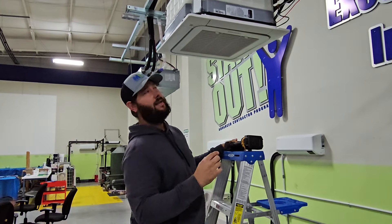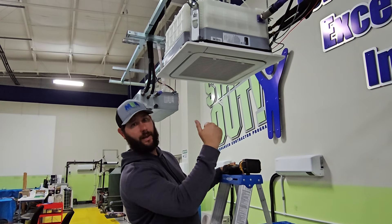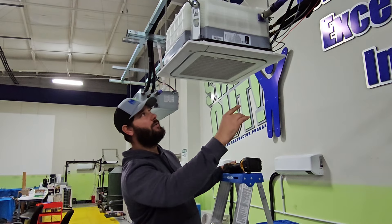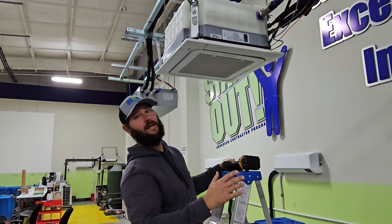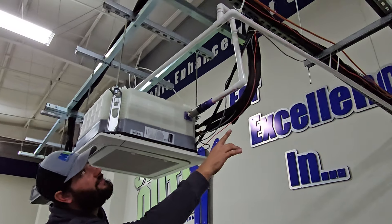This is made by Samsung, and it has a pump inside that is sitting above the indoor pan, and it has a 29-inch lift. So it will lift the water and pump it up 29 inches. You can see our drain comes out and then up.